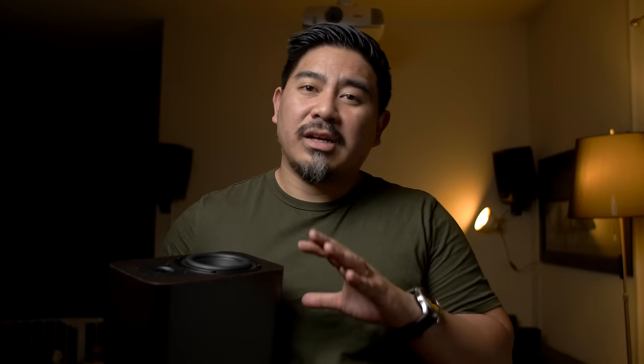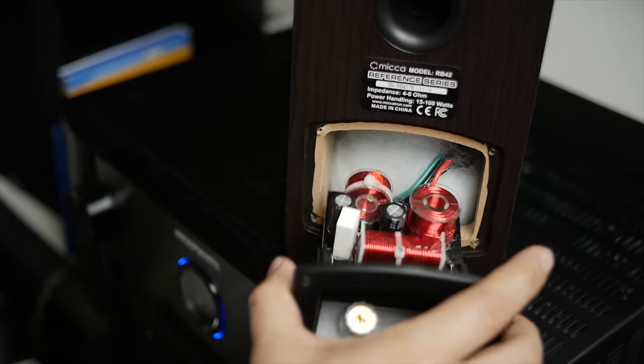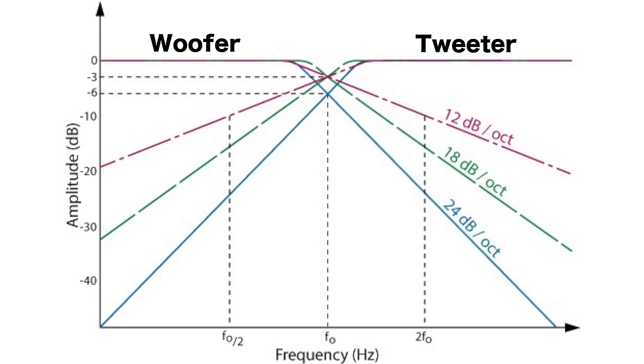These are coming in more expensive than the MB42s — I think they're shooting for around $149, and they do have a special introductory offer right now, so check the link below. One of the things they really want to show off is the crossover: it's a 10-element crossover using an 18-decibel slope. Basically, the steeper the slope, the less low frequencies the tweeter gets and the less high frequencies the woofer gets — so steeper means less crosstalk. Typically a higher slope means more components and more expense. A lot of times inexpensive stuff uses a 6dB slope, not even a 12dB slope, but they went for an 18dB slope — good on them for spending on the internals, stuff you might not see but might be able to hear.